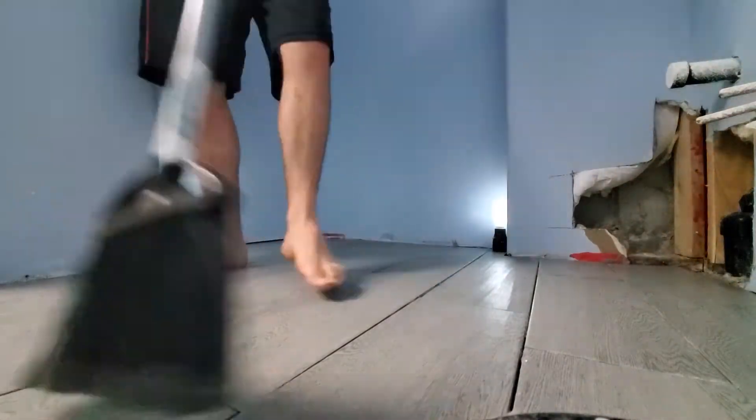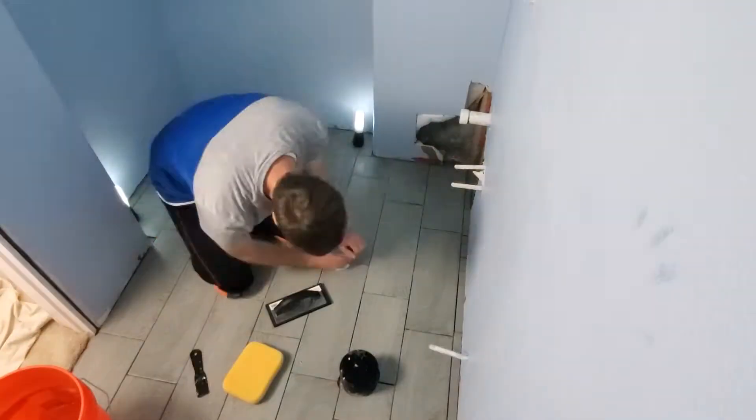The grout cleaner fits between the grooves of the tile to clean out that area, so when you put the grout in it goes in evenly. You can see there are some high spots and some low spots as I get close to the tile, but other than that it's really shiny. I swept all the extra thin set pieces and now we're on to grout.